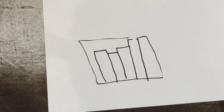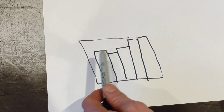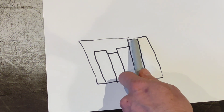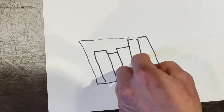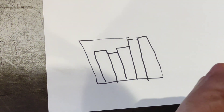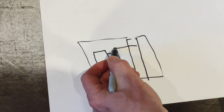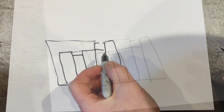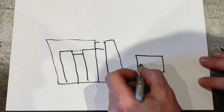This is a rough diagram of what we're talking about with out-of-balance cells. You could see one cell that's a bit low and one that's a bit high. What the balancer does is start drawing on the high cell only, pulling its voltage down, and then the whole system carries on charging until the low one is pulled up.